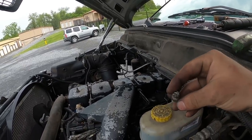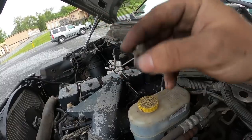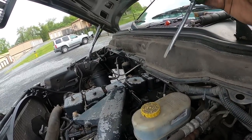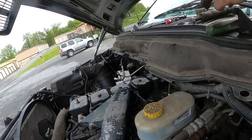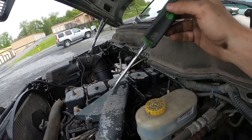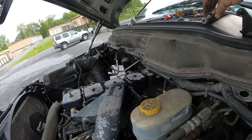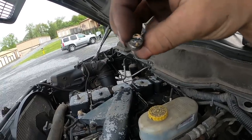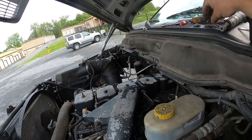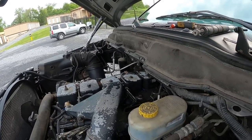I haven't pulled it yet — I waited for you guys so I could show you this. If you guys ever have issues with this screw on the back of the AFC, take a good flathead screwdriver and put a nice big vice grip on it. Because if you're just trying to push down and twist, it ends up popping itself up and you'll strip the screw. As you can see, this one's been into a couple of times, but using vice grips allows you to get some leverage — it acts like a breaker.